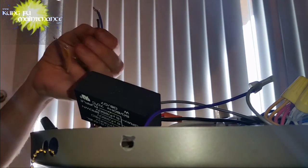Since we proved out that it was our directional switch, I can change this switch back. I need to strip the hot side. Since it's the correct color. And I also didn't like how that brown wire kind of is coming out real easy on this one. So. Anyway. So we've got the black hot wire from the switch.